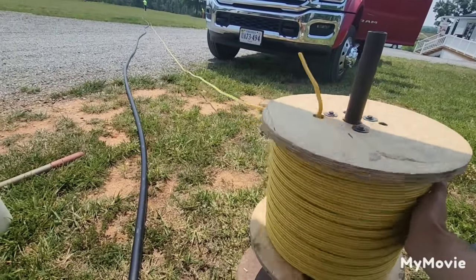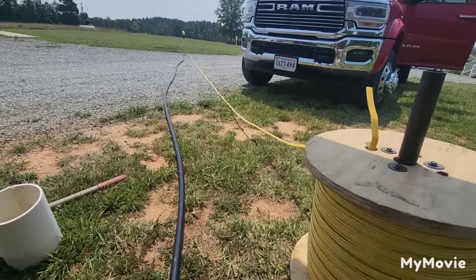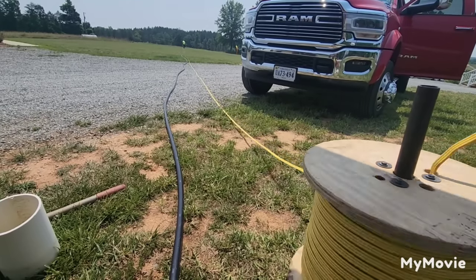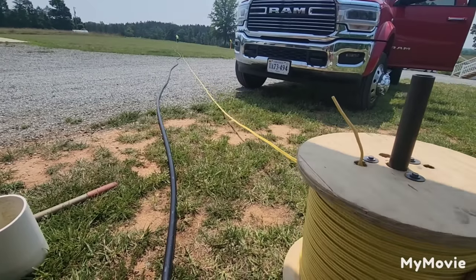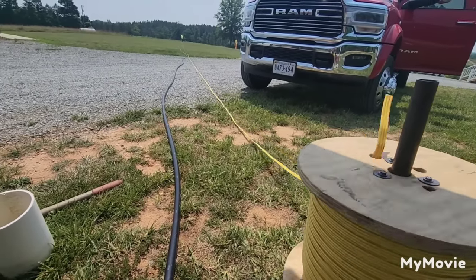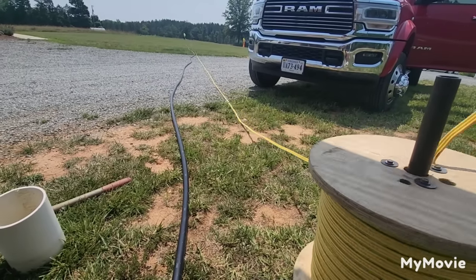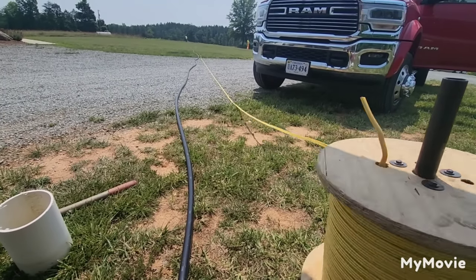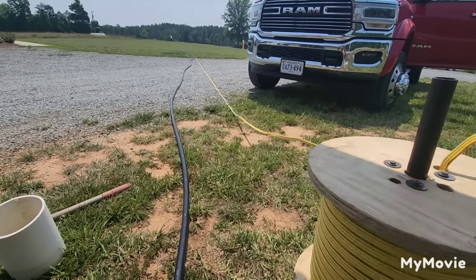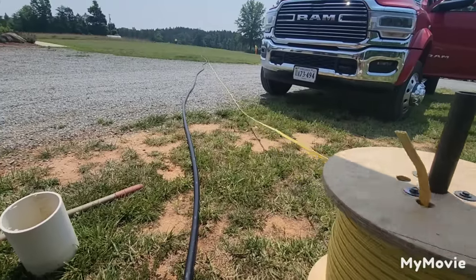They do sell wire kits — you can get them at Tractor Supply. They come in 150-foot kits with a wire splice kit all-inclusive. I actually like those because you can buy two 150-foot kits of 12-2 submersible pump cable with ground, and it comes with a splice kit. If you install your pump system at 300 feet, you just buy two of them and splice the wire.